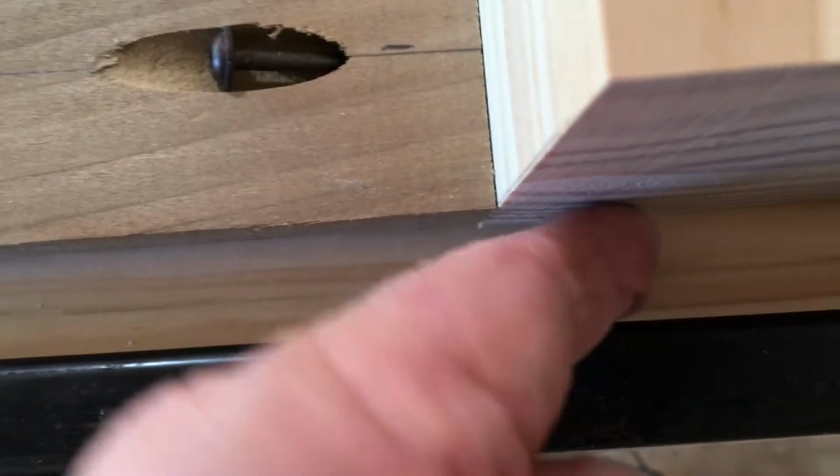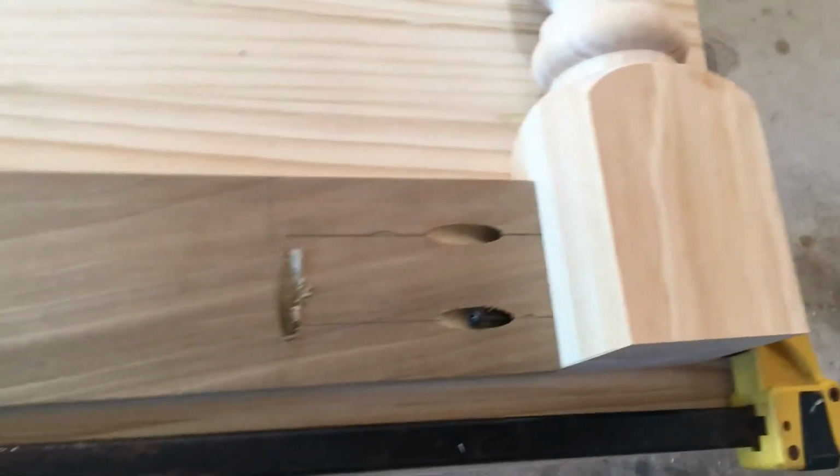And then what's going to happen is I have this little board, this little 1/4-inch board here, not much. It's going to lay on the tabletop, and then this is the thing with my screw in the pocket hole right there. It's going to come out the end. I'm going to put glue on the end of this, line it up there, make sure that it's perfectly even. This here has to be just as flush as you can possibly get right there. And then I am going to screw those together, and it'll be finished. And the reason that little tiny thing is under there is because I want just a tiny little bit of reveal underneath, but I'll show you what the reveal is when it's all done, in case that didn't show up real nice.